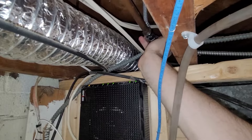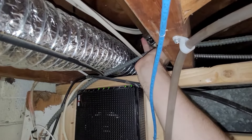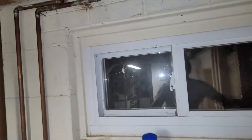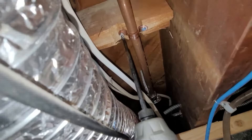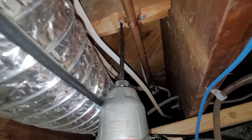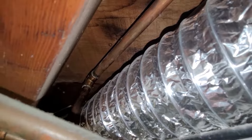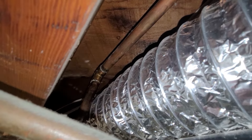In my case, the water shutoff valve is in the basement. And here my DIY OCD kicks into high gear — I noticed that the pipe isn't actually attached to anything. So I added a pipe bracket and affixed it to a joist, because frankly I don't really want to cause a leak just by jolting this around.